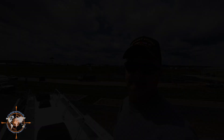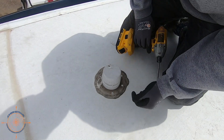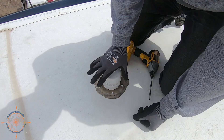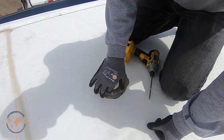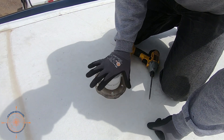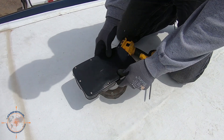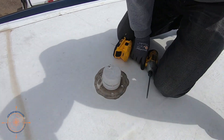DRV was nice enough to pre-wire this for us. What they do is lay the wire in the roof and put a vent cap over it. So we're going to take this vent cap off and replace it with our junction box — that's kind of step one.